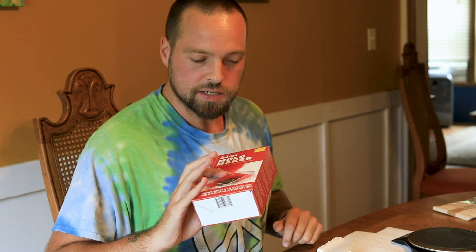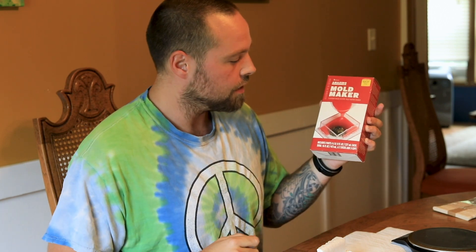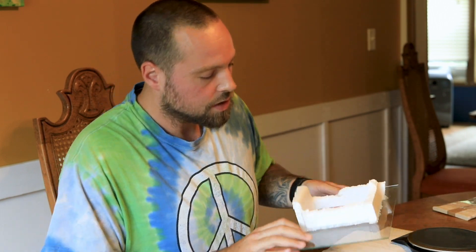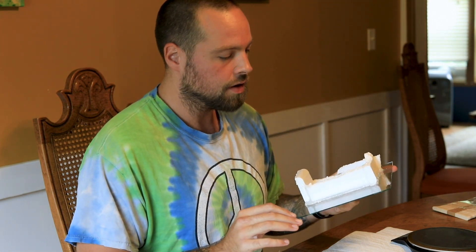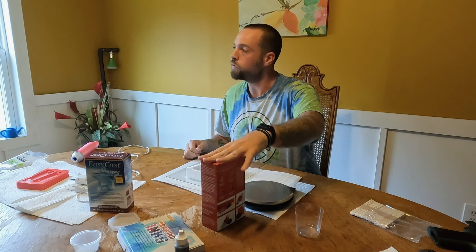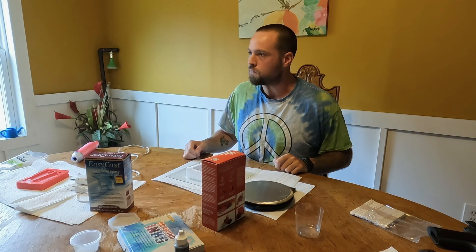First thing you'll need is a mold making kit — this makes a mold out of silicone. But to use that, first you have to construct a mold box. I took some 1911 grips and just hot glued them down to a glass pane from a picture frame, then used some scrap styrofoam to make a box around that. That's how we'll make the mold for our epoxy resin — nothing but hot glue, glass, and styrofoam.